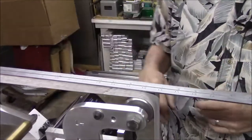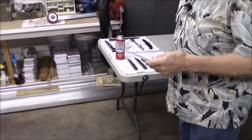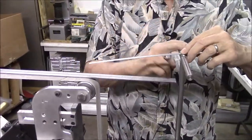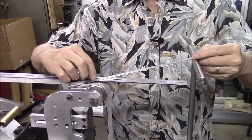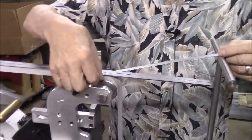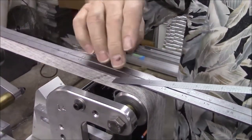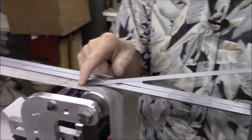It's a little harder to set your angle accurately. We start off by establishing our angle. I use a 10-inch length from the support bar to the area of the grind. I like to put the area of my grind about one inch behind this wheel because the belt's fairly rigid there.